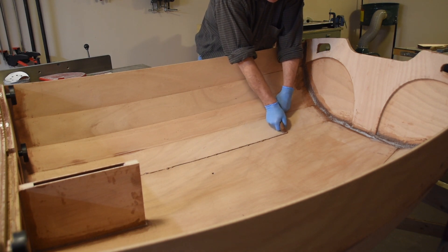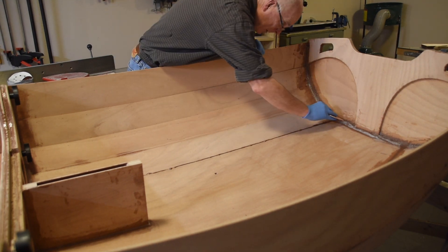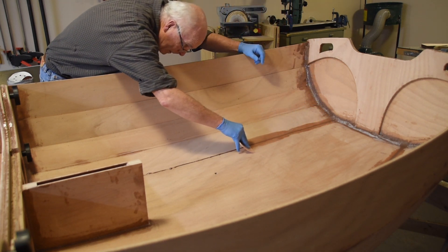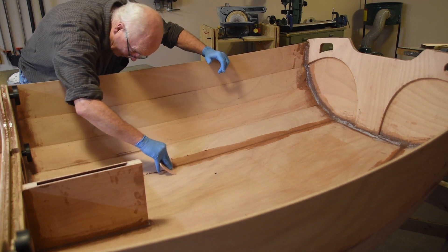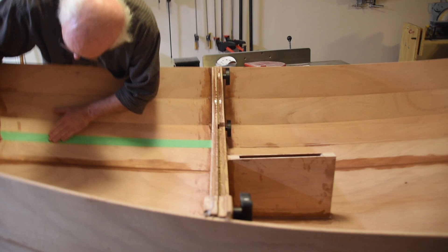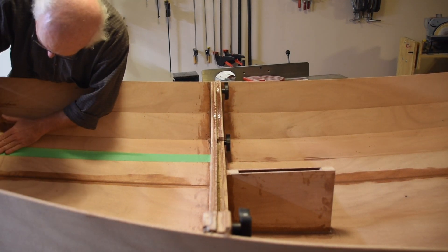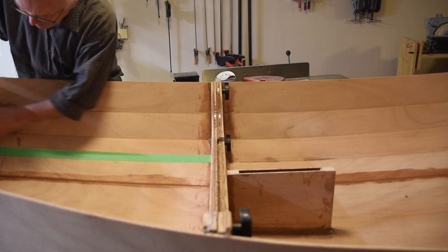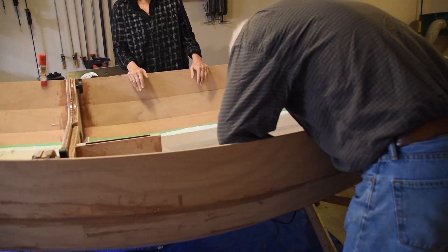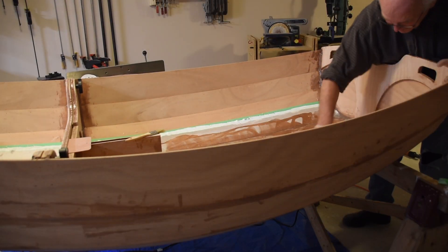The next step was to put down a bead of thickened epoxy in the gap between the bottom and the first plank. We used freezer bags — we put the epoxy in, clipped a corner, and squeezed it out, kind of like decorating a cake. First time I tried that and it seemed to work pretty well. Then we put some tape down just above the first plank in the hull as far as the fiberglass and epoxy was going to go. With the tape in, we started to fit the fiberglass — it's nice to have two people for that. We spread the fiberglass cloth out and trimmed it to size just over the green tape, then applied unthickened epoxy on the bottom, spread it out, and let it cure.